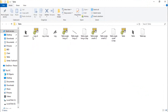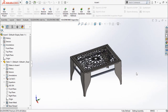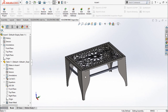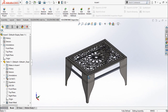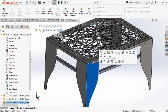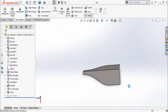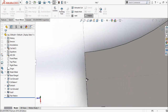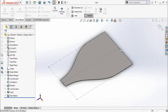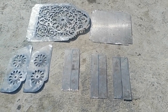Here is the table — I have all SolidWorks as well as the DXF files for it. One more thing: how will you know where to add the bends? For that I have marked the sheets. When you make the flattened pattern, you will get the precise bend locations — for example, here you can see these marks. All these parts are for the chair.